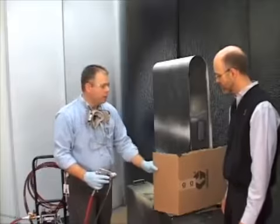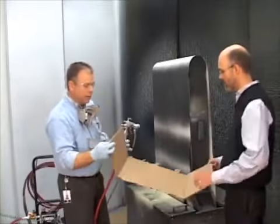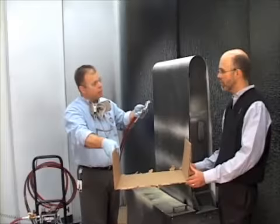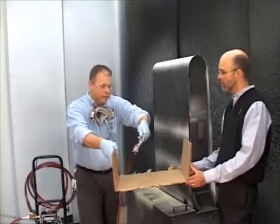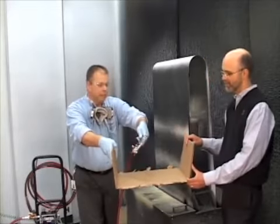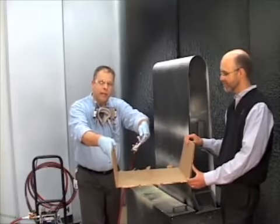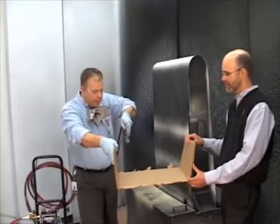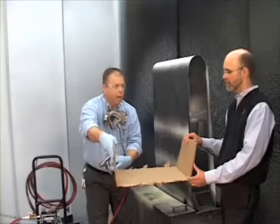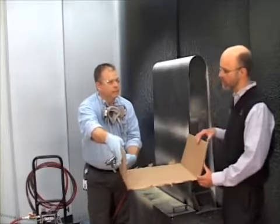Next thing I want to talk about before we flush is inside corners. If I come in and attack the inside corner the same way I do an outside corner, what's going to happen? You're going to get some buildup — because my edges are closer here than my middle is to the center. So when I attack an inside corner, I want to come in like this and then come back along this edge, putting the edge of my pattern down into the corner. That way you should have consistent coverage here, consistent here, and everything gets into the corner.